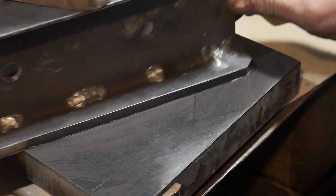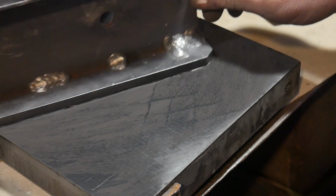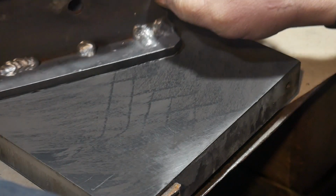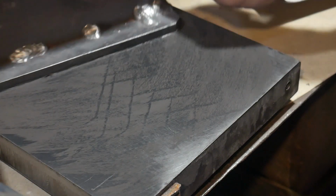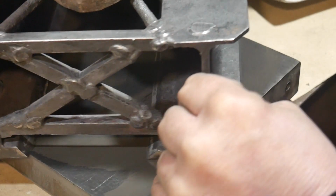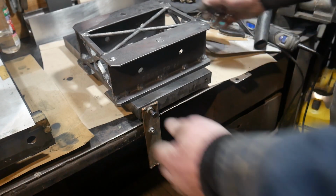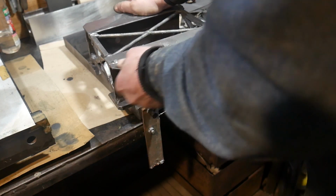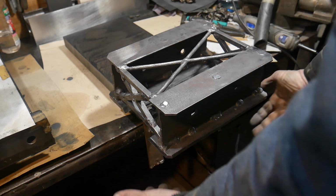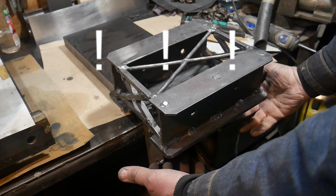Surface wear must be uniform. If the workpiece is moved evenly, covering all places, the workpiece becomes flatter. Also, the lap will become flatter the more it is used if moved evenly and randomly. Stuck, not going to fall.